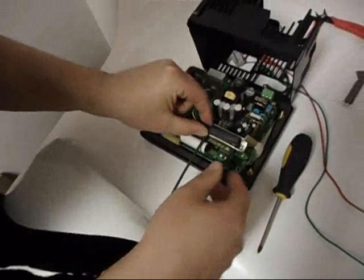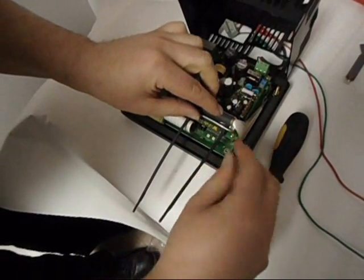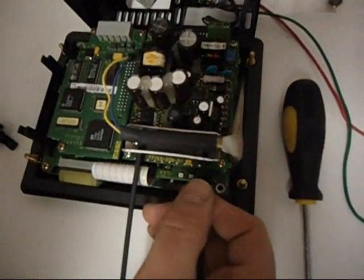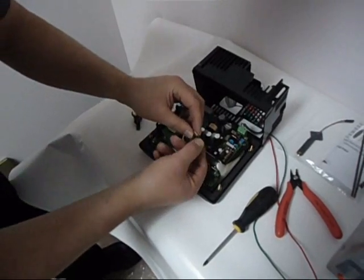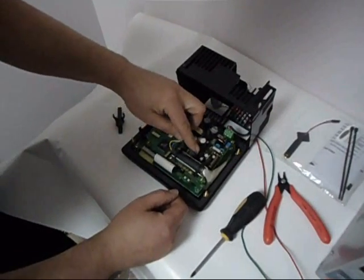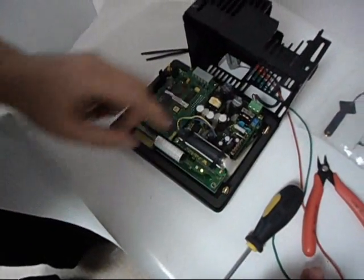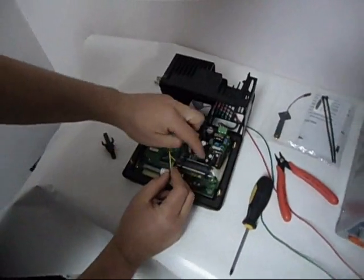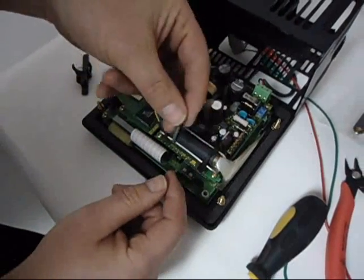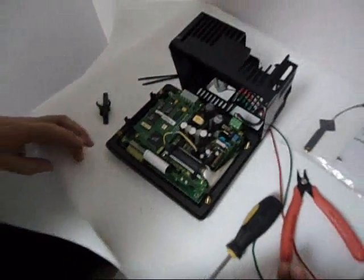This simple LED goes inside the fiber optic — or the fiber optic goes inside it — and so all the light gets pushed in there. This cable can be plugged in either way. If it's plugged in the wrong way, it just won't work — no big deal. For example, if I plug it in this way, turn the power on, you see the light turns on here but the LED doesn't turn on. Allen Bradley sometimes puts their connector in backwards, so the only way to do it is to flip it. Just flip your cable around, plug it in the other way — it has a diode in there to protect it, so nothing bad will happen to it.